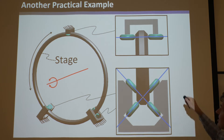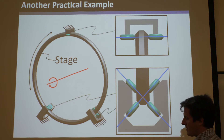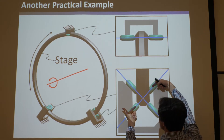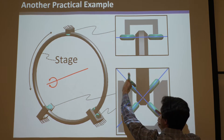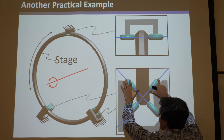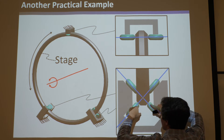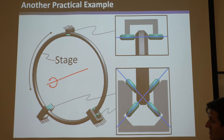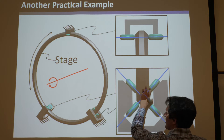In reality it's necessary because this joint would just collapse one way or another - it would just fall over. So you kind of need to pinch it to constrain it so it behaves as it should. Then on this side you have four wheels, two on each side. And from gravity, you wouldn't necessarily need the top two - you could save money and remove them, and gravity could preload it down onto just those, which might mean less friction and less over-constraining. But just to be safer, it's a better design to pinch it so there's no way this thing comes out - that would be really bad if it fell out when someone tried to lift the hoop.